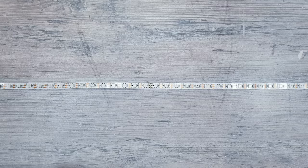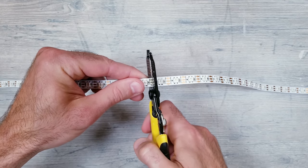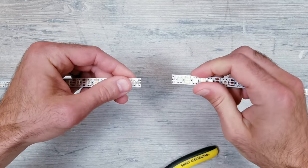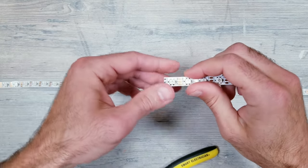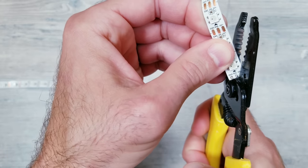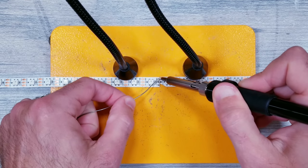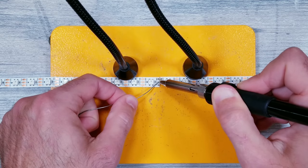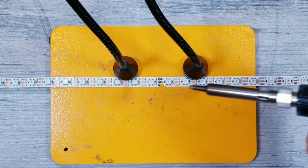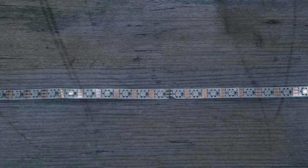If you want to use a separate power supply, there's one thing you need to do: since voltage from different power units should never cross, before installing the LED strips on the wall, cut them at about the halfway mark — ideally at a spot with an existing soldered joint. Once you have the two pieces, cut off one of the 5 volt copper pads, then reattach the two strips by re-soldering the ground and data. After that, connect the two power injection wires at the end to a completely different 5 volt power supply, but since data and ground are still connected, all animations will continue to flow perfectly throughout.